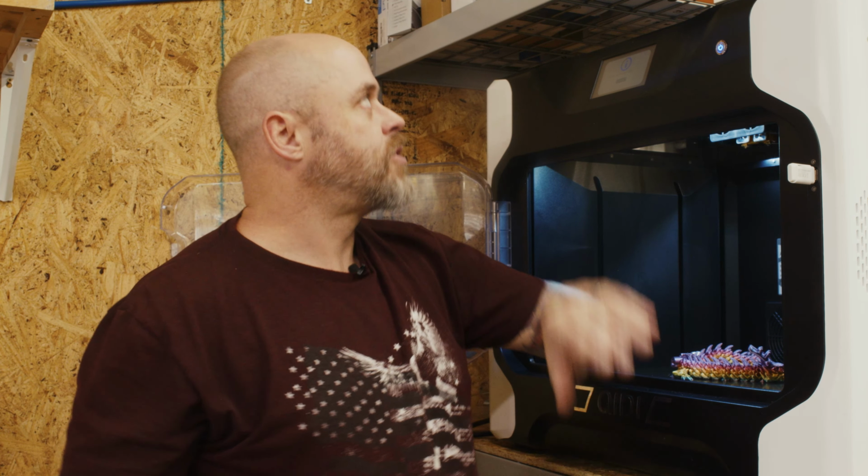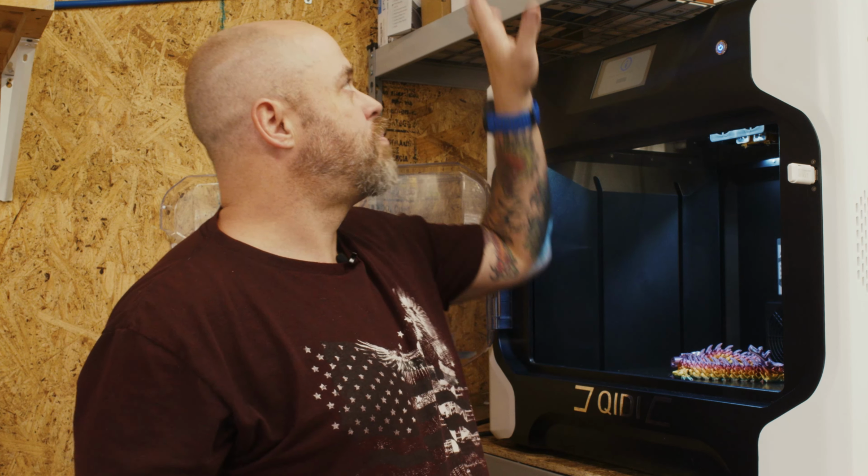So I've got a 2-spool filament dryer up here that I can just pull everything out of. When I put a new spool in there, I just go ahead and run a drying routine depending on what the material is, how long, and what the temperature is. That's going to come down around the back and then come back in, and I'm using a Bowden tube in order to keep the filament from getting too tight on any corners.